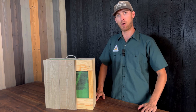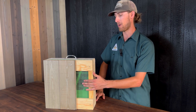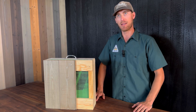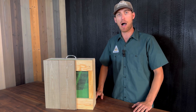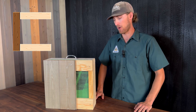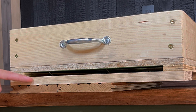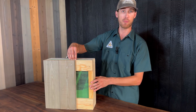The issue with that is that you can't put the horizontal furring strip directly up against your sheathing, as it will create an impeded drainage plane. What that means is that the ventilated cladding system or rain screen is not going to operate in the way that it needs to. Due to the orientation of vertical siding, we have to add an additional member — a vertical counter batten — to float the horizontal furring strip off of the sheathing and create a drainage plane through the system.